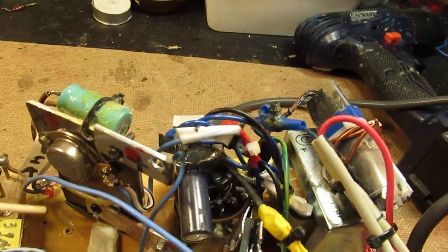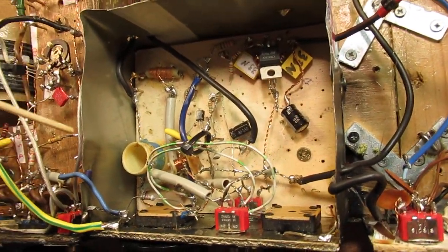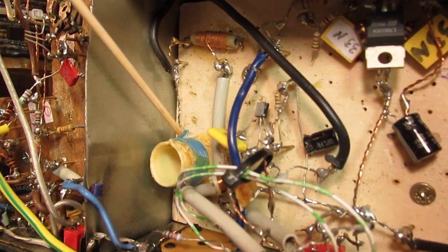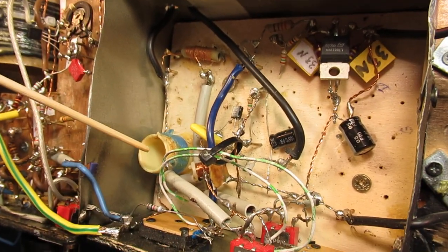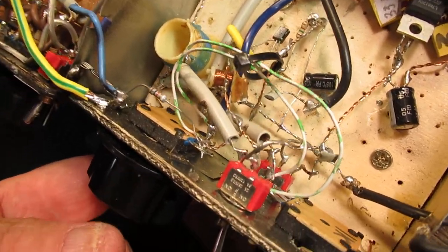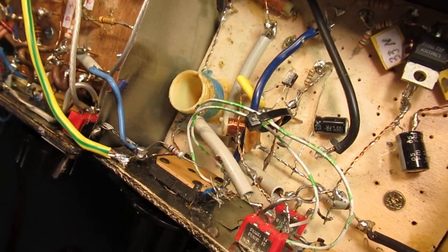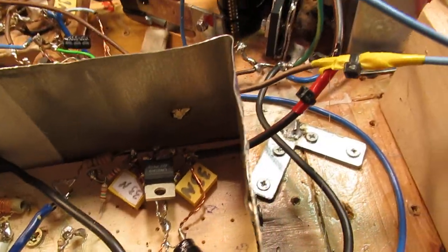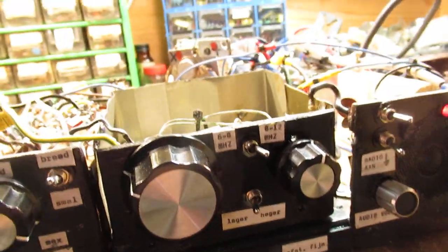Power supply, of course, here. Well, a local oscillator, very important, made with a field effect transistor, and I will show the schematic. Here is the local oscillator tuning coil, and parallel to that coil there is a diode, and that diode is driven with the help of a potentiometer. In fact, it does the job. It gives the voltage to the tuning diode. And I've made also fine tuning here, and I will show the schematic. Anyway, let's listen.